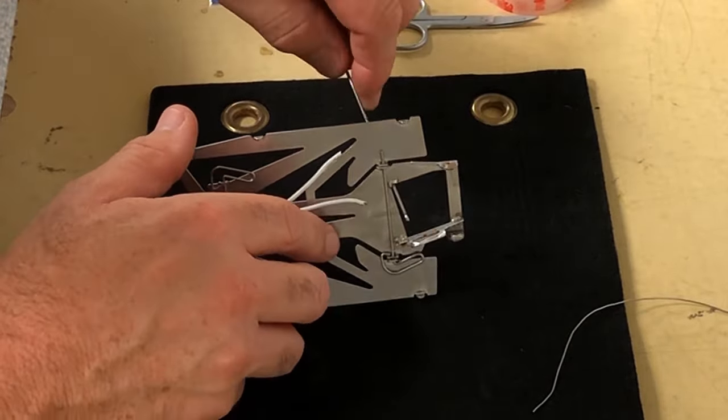So these are all pre-tinned. So I'm going to go ahead and strip these wires. This is a high-grade silicone wire with our silicone-coated wire. So you can pretty much pinch it with your fingernails and pull the ends right off of it, just like that. Just give it a little twist.